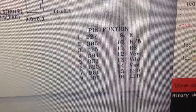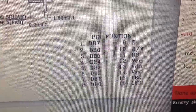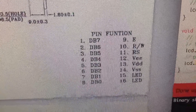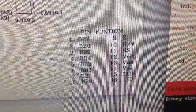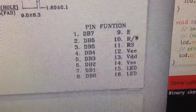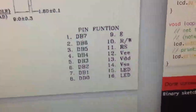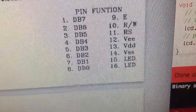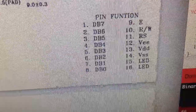The only pins I really needed to connect to my microcontroller were pins 4, 3, 2, and 1 — DB4 through DB7 — and I connected pin 9, which is E, and pin 11, which is RS. RW went to ground, and VDD and VSS are 5 volts and 0 volts for this LCD.